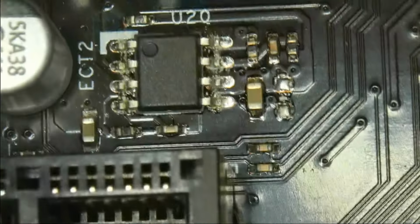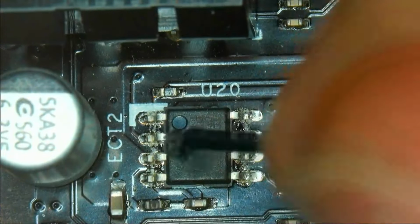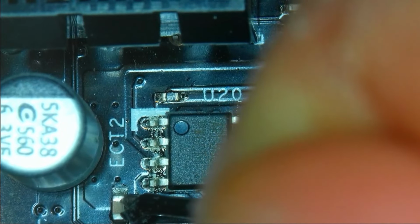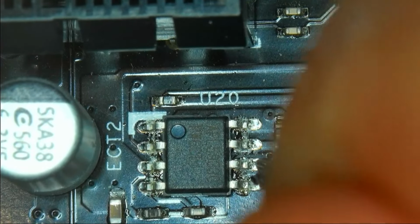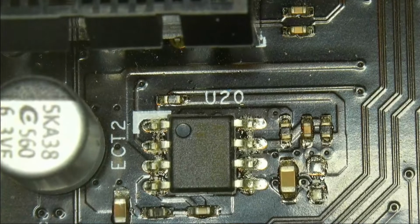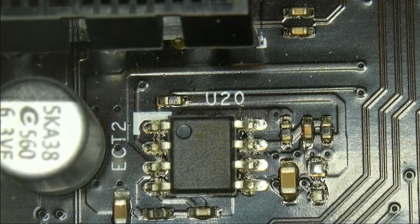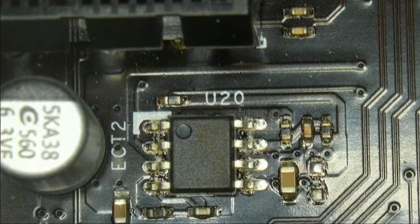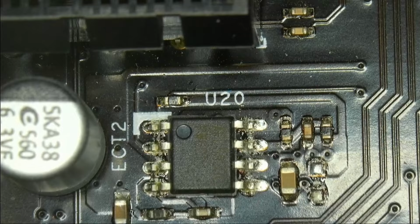And also on this chip right here, I was able to find online that the pin we were looking at, which is this one, is its input. So on its input we also have 2.5 volts, fluctuating, and this is its output, which has nothing on it. So these two are not responsible for our problems, because they too take this 2.5 volts as an input. So I think these 2.5 volts that we see are supposed to be our 3.3 volts, but are still 2.5. So our search continues.